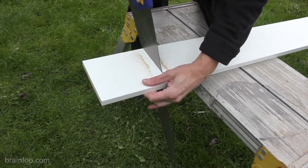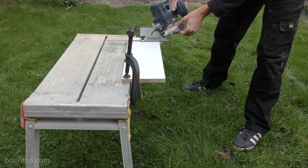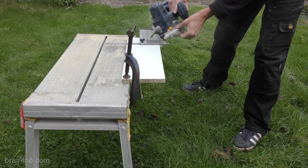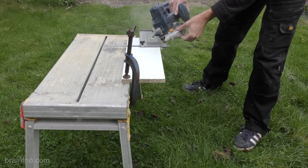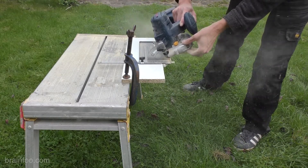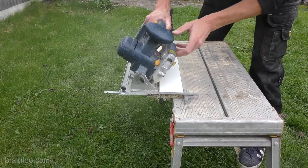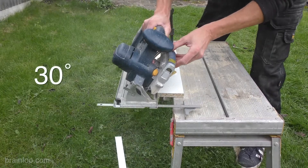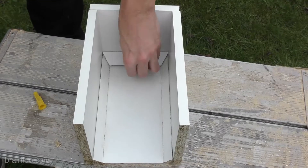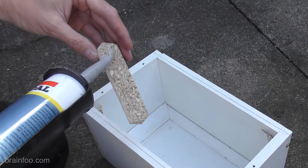The two end caps are next and when they're cut they fit onto the end like this. The last fillet strips to cut and shape are the ends of the hammer, and for that we need a 60-degree angle. Ignoring health and safety, I took my circular saw off its stops and forced a 60-degree cut — this really is the only tricky cut to make. With that done I can run down the other side at a much more sensible 30-degree angle, leaving us with these sharp-looking right angles.